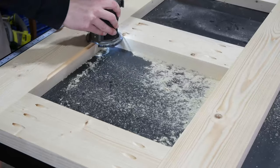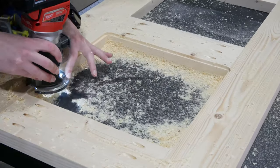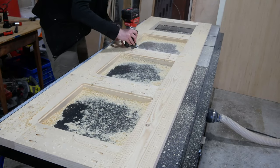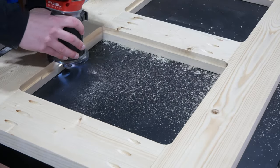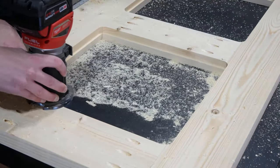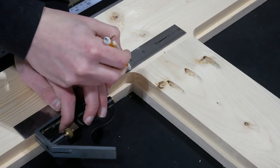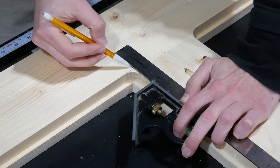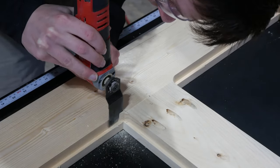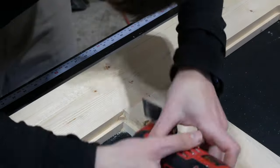I needed to cut a rabbet on the back of the door to inset the frosted glass panels, so I used a rabbet bit set to a quarter of an inch deep to cut a rabbet groove on the inside of the door pieces. As this is a large diameter bit you'll really need to slow the router down — I don't recommend using a bit this large with a router that doesn't have variable speed control. I made several shallow passes until there was five eighths of an inch left on the front part of the door, which will inset the one eighth inch frosted glass panel directly in the center of the door. Unfortunately router bits leave rounded inside corners, so we'll need to cut these out square so that the panel can fit down into the door. To do this I used a straight edge to continue the lines to the corner and used a plunge cut blade on an oscillating tool to cut these out. This is a bit crude and the proper way would be with chisels, but with 16 of these corners to cut on every door, this saved a lot of time and actually worked surprisingly well.